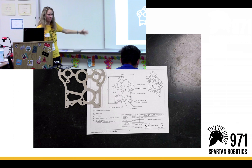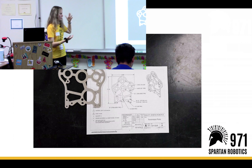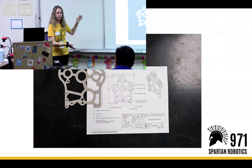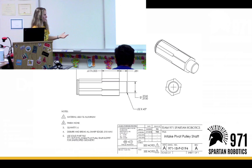Sheet drawings are basically for the router parts, most of the router parts. Before we even get into manufacturing, once CAD is done, we make the drawing to make sure we know what the part is. And once we manufacture it, we can put it together with the part so it doesn't get lost, and we know how many we made and where they are in the assemblies.